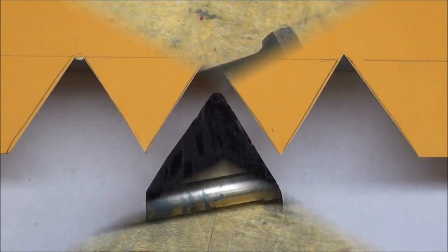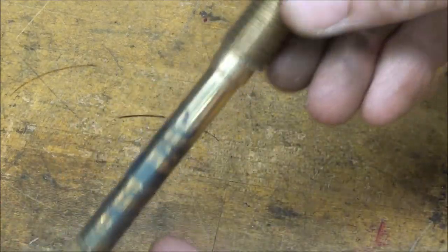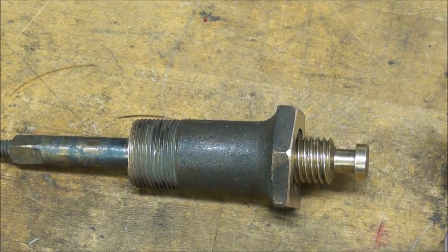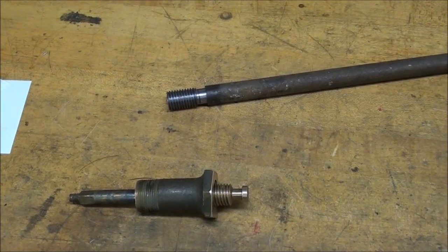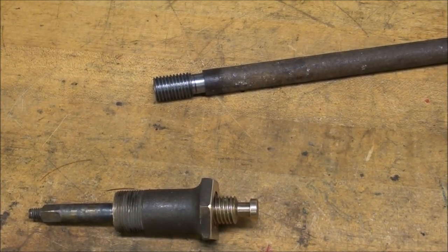Hope that clears things up. And there it is — a double thread, a two-start thread. There's the original brass one. If it's a three-start or a four-start, you just have extra steps, extra cuts to make. We just made two threads here, but with a three you'd have three threads; with a quadruple start thread you need to make four threads side by side. I hope this was interesting for those who might do this someday, or that it takes the mystery out of it for those who never intend to. This is Tubal Cain saying so long for now.